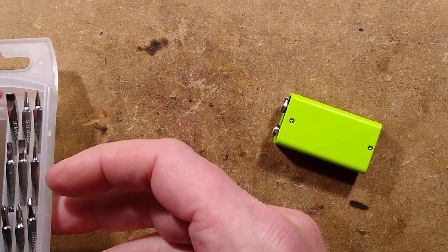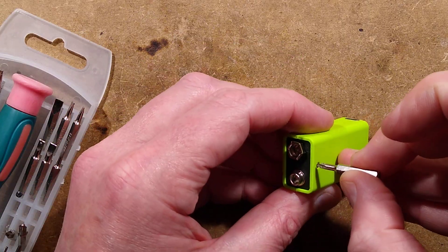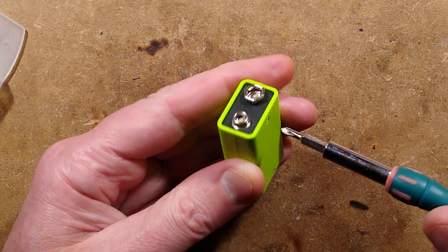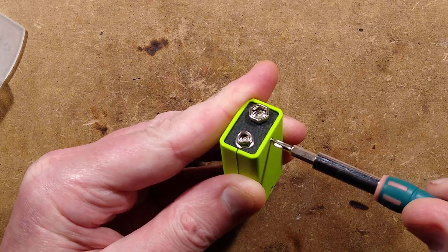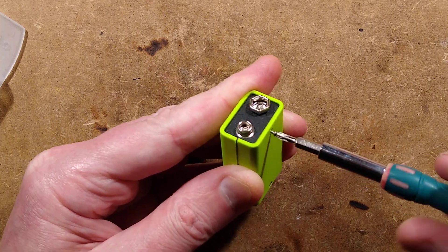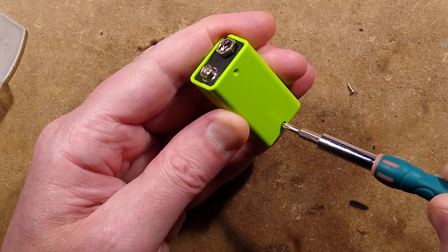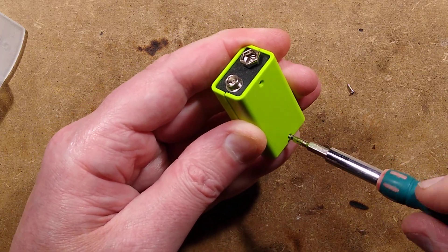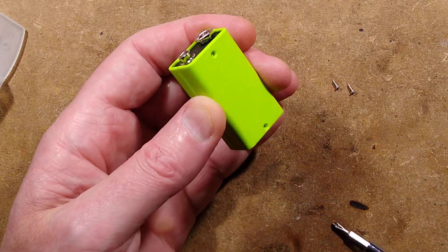Because the circuitry just isn't designed for it - it expects a traditional 9 volt battery that puts out nice smooth DC. When you put in something like this, sometimes some of the switching noise comes through and finds its way onto the audio path. Let's see if one of these screwdrivers fits it. Nice that it actually screws together. What am I expecting? The 6 pin charging circuit, another little 6 pin boost circuit maybe? Not really sure, and then as much lithium battery as they could fit in. Traditional nickel metal hydride batteries are about 200 to 280 milliamp hours - this one claims to be 400 milliamp hours.